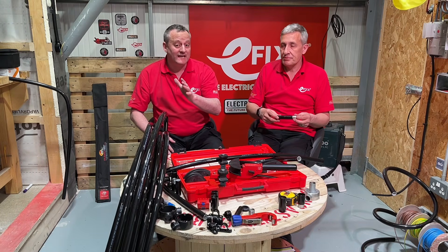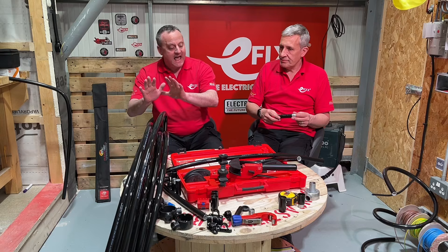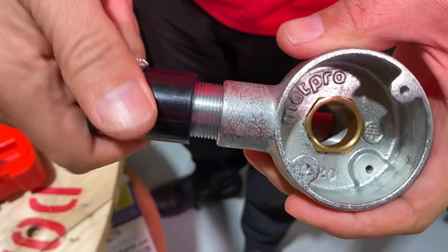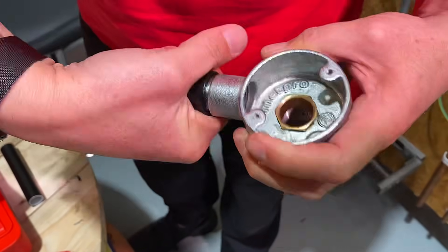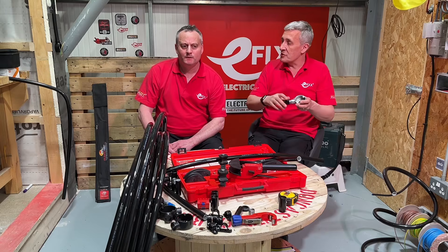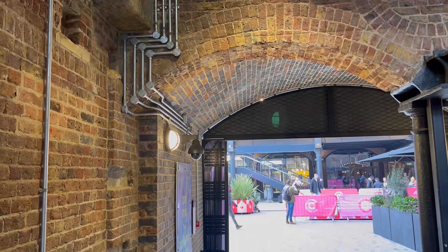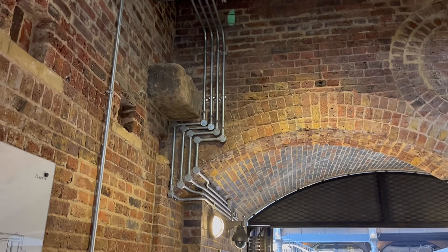It hangs similarly to a steel wire armoured cable — you're never going to get it absolutely flat to the surface; there's always a slight variation regardless of how many fixings you put in. Just like MI cable, how you roll it off the drum is vital for the installation. The great thing about Super Tube is you can mix and match easily between systems. Adapters take you from the Super Tube to a regular threaded nipple, so you can go straight into a conventional metal conduit box, or use regular plastic conduit boxes if you don't need the screening.